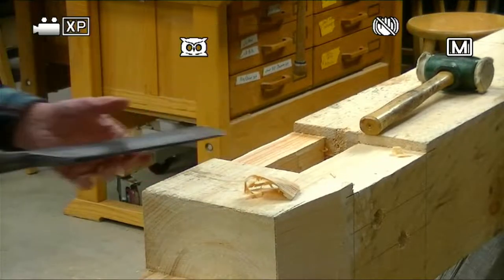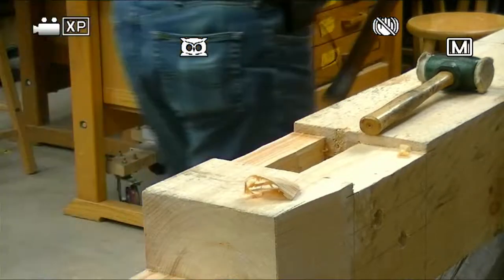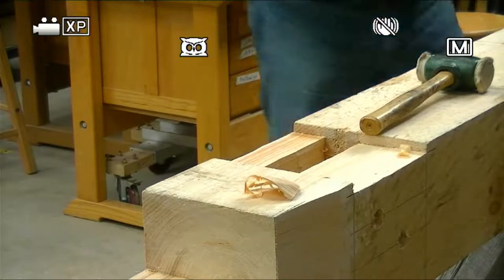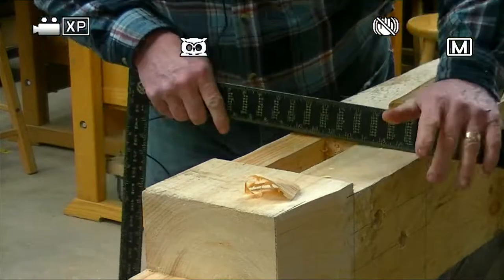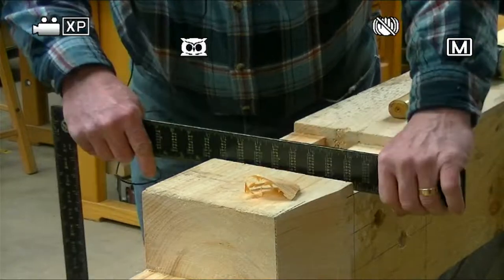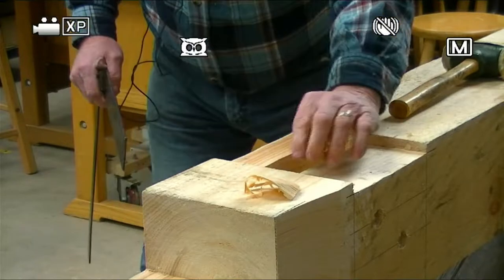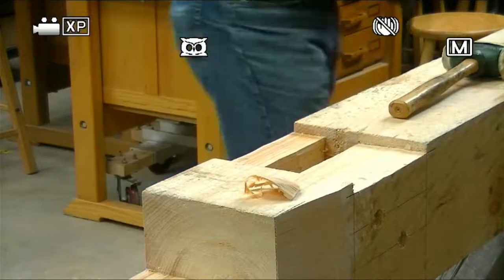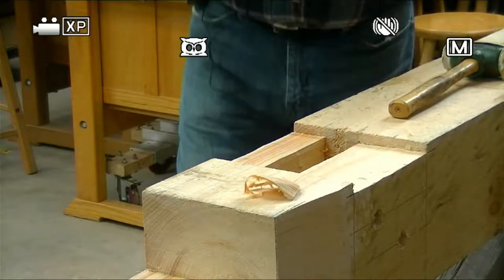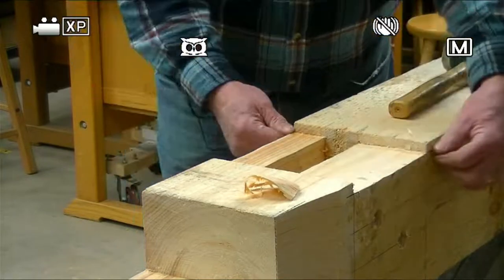So, looks good there. I've got that part done. Then you ask, is it really done? Just like on that tenon over there, I need to make sure I don't have any high spots in the middle. I want to be able to touch just the edges. There's a little concavity here, which is okay — it's down about under an eighth of an inch in the middle, which is fine. The reality is that will never be seen — it's completely covered, but it makes it so you're never going to have any issues when putting it together. It's tight on the edges, which is all you're going to see.